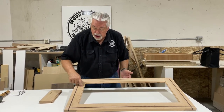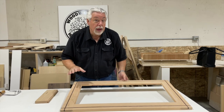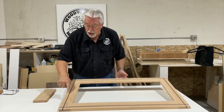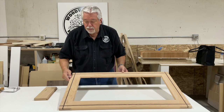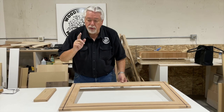This is cherry wood that we've used, and our inlay is black walnut — a Peruvian black walnut. When you lacquer Peruvian black walnut it goes really dark, so this is going to be a real contrast between our natural cherry and our dark walnut. It's really going to highlight that inlay strip. So let's put on our final sand and our routed edge — routed edge first, then final sand.